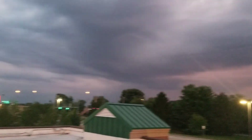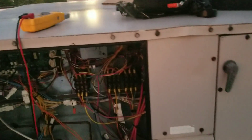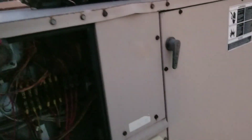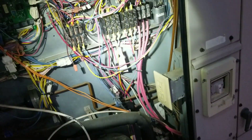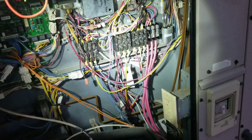I got a little bit of a storm moving in, hopefully it's gonna stay over there. Another thing I made sure to double-check was our ice cube relay — I did verify it's pulled in. I have an amp draw; it's kind of dark out here but I got about 1.5 amps on my good motor and 3 amps on my bad motor. I'm gonna go ahead and disconnect that, put a piece of cardboard over it. Also, stage 2 isn't running — I'm not real sure why, but it could be off on high head. When I figure that out I'll bring it back.